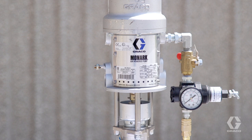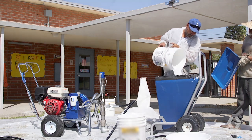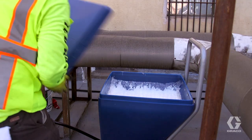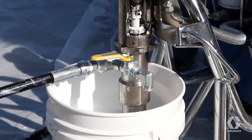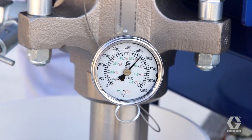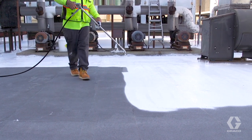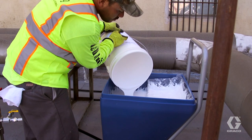The feed pump system has the advantage of keeping the material sealed throughout use. The second best method for delivering material is a hopper, which provides a good amount of head pressure that allows material to easily flow to the pump. Direct immersion of the pump lower into a bucket is the third best way to feed the pump, although it can be difficult with cold or thicker materials. If ball travel is set to maximum and the system is running at good pressure but the spray pattern seems sparse, most likely there is a material delivery issue, which can overheat the pump and damage components. Best practice would indicate that you should utilize a feed pump or hopper when possible to avoid downtime and issues.